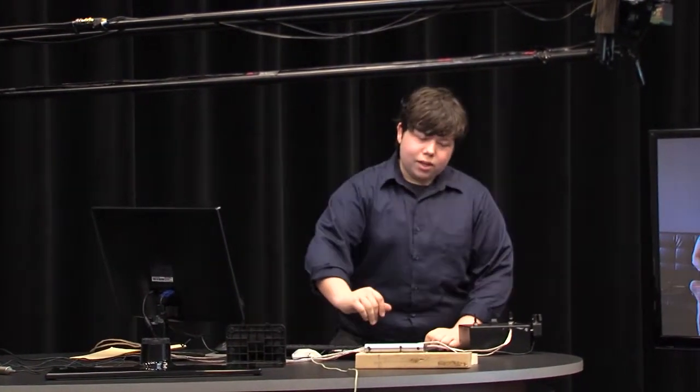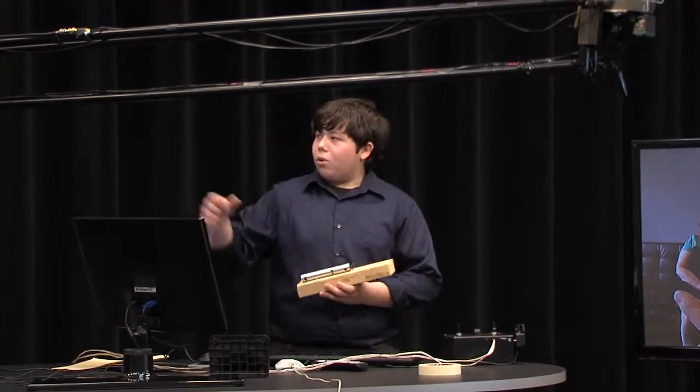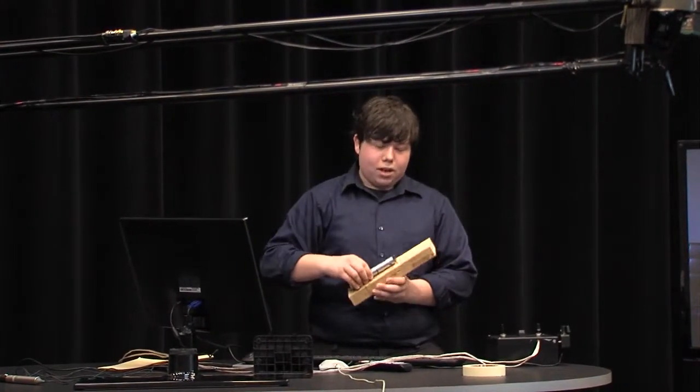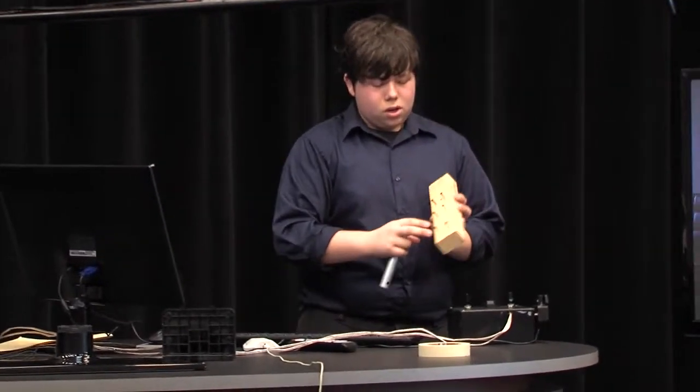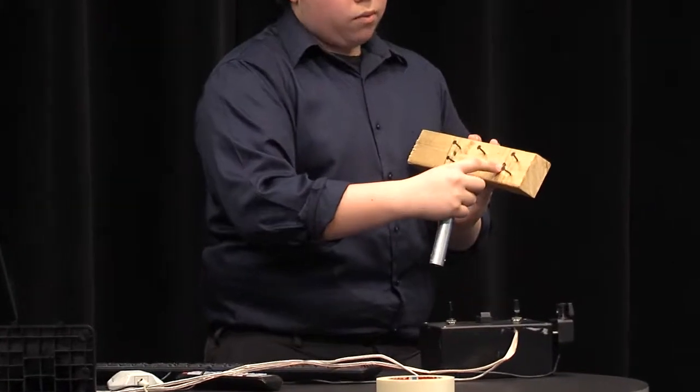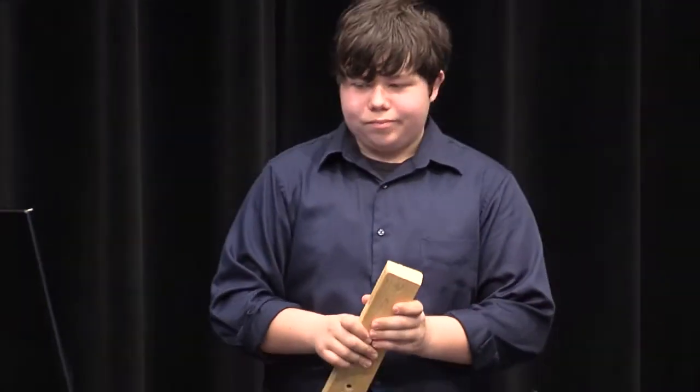And then probably the hardest part was trying to create a straight hole to go through, so Mr. Mackey helped me build this jig. We used screws and wood. We marked out for every bar how far to stick it in, so we could drill it and then clamp it down, so we would have perfectly straight holes. Because the first time I tried, I just went right through, and they didn't go straight. They went sideways, and the whole thing would not come together.